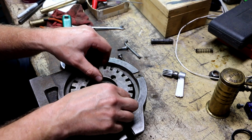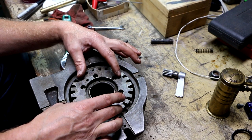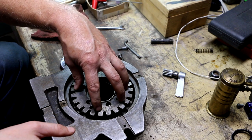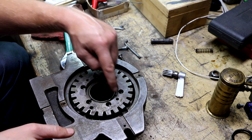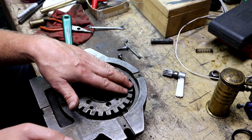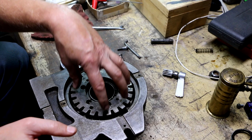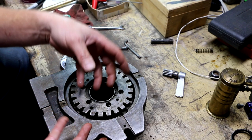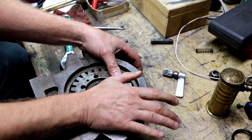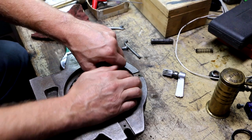And then the idea was to make it a really quick acting super spacer. There was a thin steel plate like I showed, I think, earlier in this video. And that's called a masking plate. And what the masking plate does is it bolts right to the back of this master ring. And that's what these two holes are for. So these two holes are to mount that masking plate, which is that thin steel plate. And that would obscure all but certain ones of these grooves, thereby converting this instantly from 24 divisions to, say, 3 divisions, 4 divisions, or whatever. So that's what I do not have for this super spacer. But again, just like I already mentioned, that doesn't mean that this isn't still pretty versatile, because it still has the 24 tooth master plate in it.